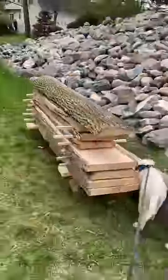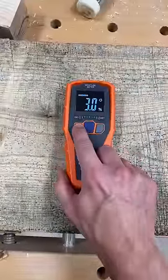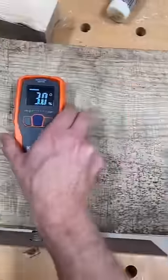Stack the newly cut lumber and wait two years. Generally, hardwood should register between 7 and 9 percent on the moisture meter for furniture making and other hardwood activities. As a married man, I'd say this is more than adequately dry for my purposes.